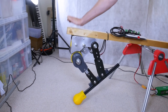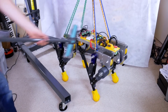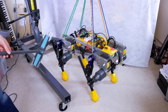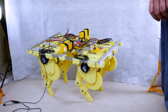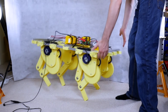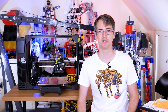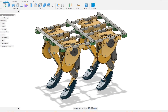They have a motor with some holding current holding them in position, but we can still force them to another position, which makes a virtual spring. I've been experimenting with dampening that spring using various controllers, and I made a dog which basically I could hit with a broom and it looked really dynamic. Unfortunately it wouldn't hold its weight up due to the back-drivability of the joints, so I've gone on to make another version which is completely 3D printed - it does have some aluminium extrusion in it, but most of the parts are much lighter due to being made of plastic. That dog does support its own weight, and I'm at the stage now where I need to make the feet for it. I'm going to use dual extruders to make hybrid feet with a rigid piece encapsulated in a flexible material.